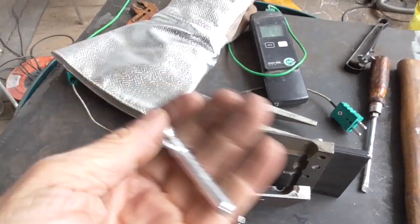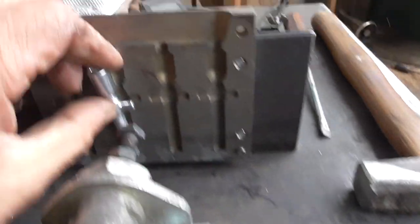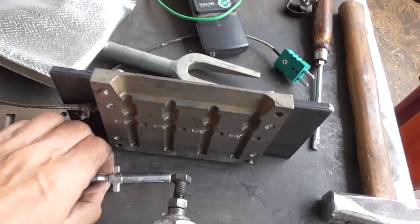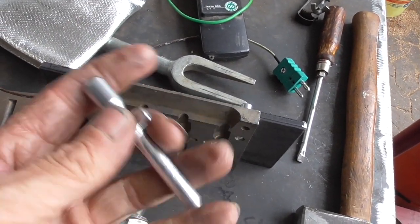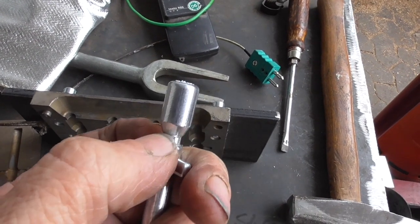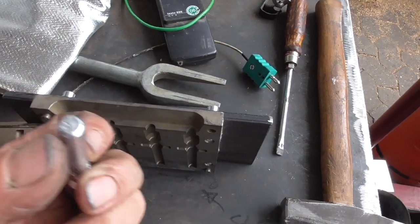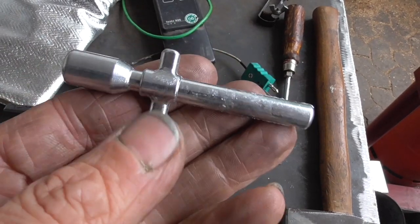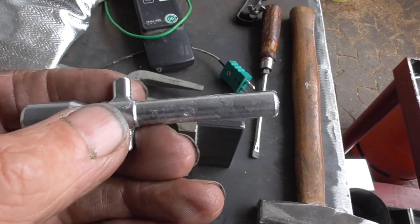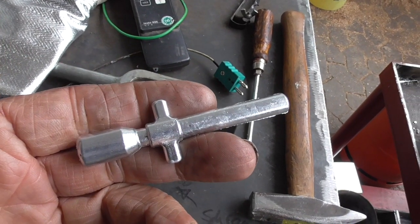This is a part that was cast in this form — it's for adjusting the clutch cable. Obviously not machined yet. This cylindrical part here is for clamping and will be cut off after I have cut the thread here. It's M7. Then I drilled that long hole through all the screw — nice part I think. A bit nasty to drill, through the sink, but such a length — I think 2.5 mm bore or something like this. But yeah, it works.